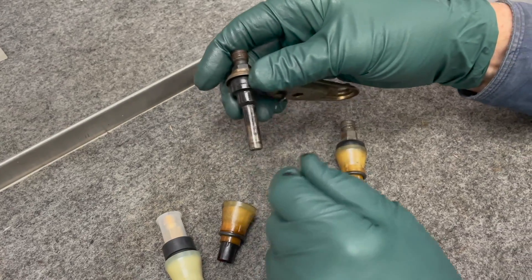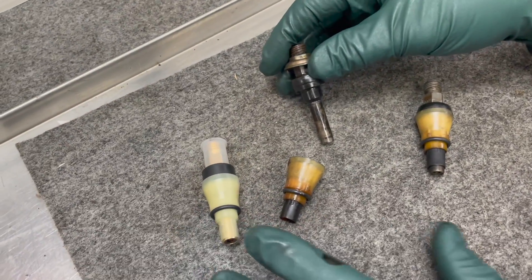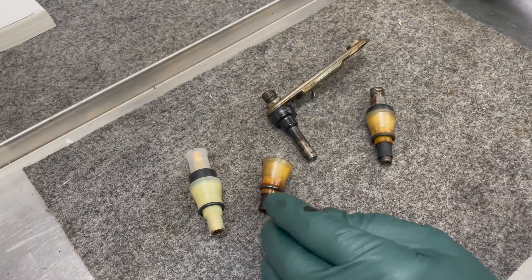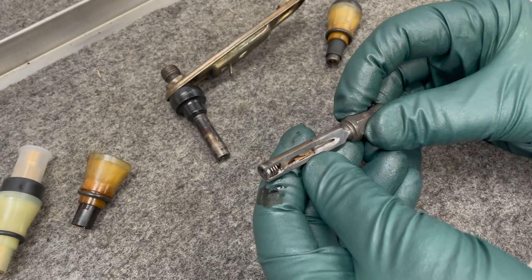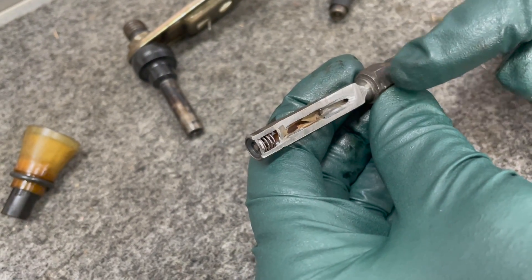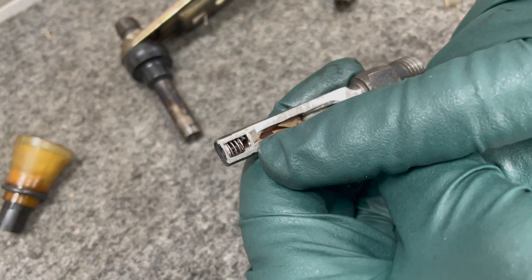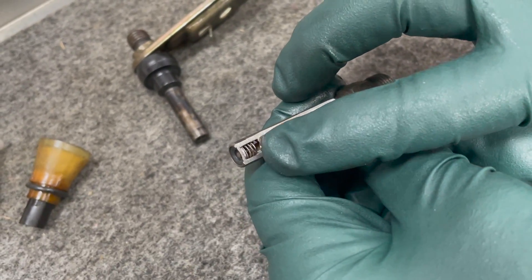What I'm going to do right now is show you a couple scenes of recently testing some fuel injectors we removed from a good running KJet engine. We're going to put a couple of these old ones on my tester, and then we're going to compare it with a new one so you can see the difference in both the release and the spray pattern. But I thought it'd be interesting for you to see what's inside one of these. They are not repairable. They are not serviceable. You have fuel come down through this long nozzle, and right there is a filter. That little filter can become a problem over time.